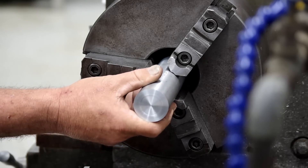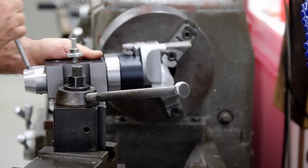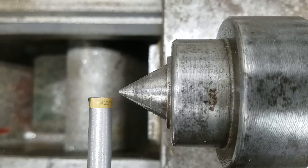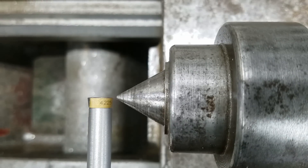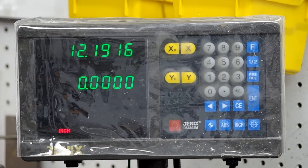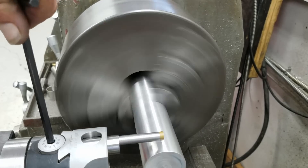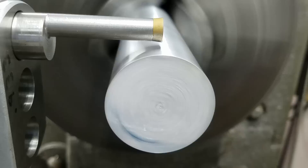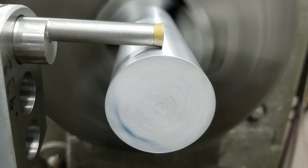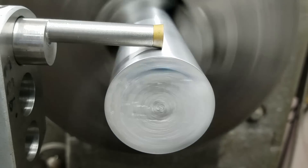This is just a piece of an inch and a half 6061 that I saw-cut the end off of. Here I'm moving the cutter up against the nose of the live center on the tail stock so that I can align my y-axis, and I zero that out. Now since I'm going to cut a full hemisphere on this end, I'm going to lower the cutter down until it just touches the material and get a scratch cut — that's half of one and a half, so it's going to be a three-quarter inch radius all the way on the end, and that will give me a full hemisphere.